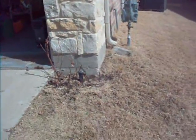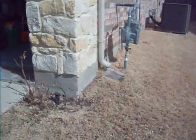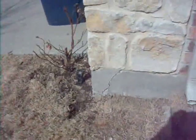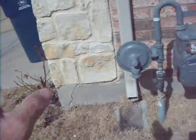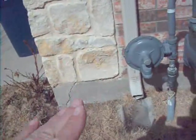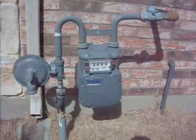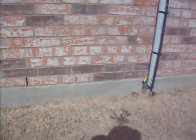This is the foundation inspection. We have a quarter pop here, very common, nothing to worry about. What can be done is parge around the area just to lock it in place, because it can fall out. It's quite ugly, but it's a common occurrence, quarter pops. Happens at corners because they're stress concentrators.